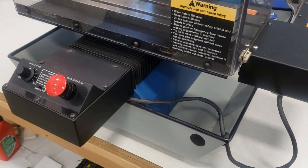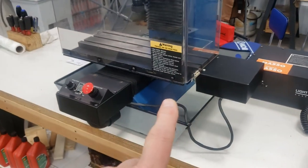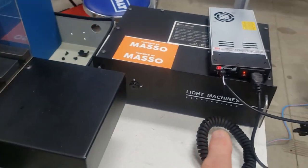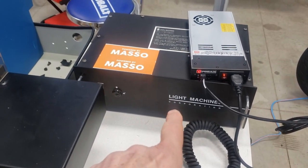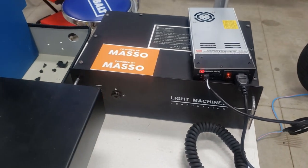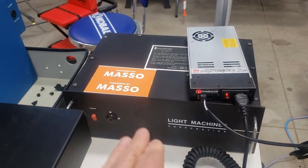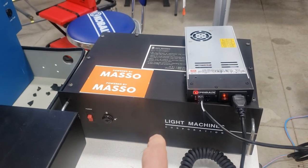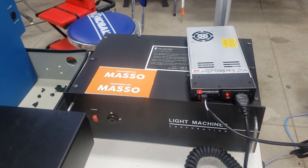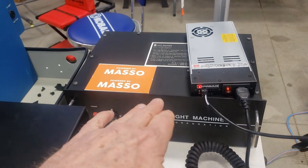I can include some tables on what color the wires are. However, I do have to warn you that with all of these machines the wiring is different — in fact, the control boxes are different. This is your standard control box for light machines. It has some very dated circuit boards in there, and a proprietary card that goes into your computer that operates it on proprietary software. The thing to remember is that these are not the same — one machine will be one way, another will be another way. The interiors of these boxes — I haven't seen two the same. I understand there are probably about four different types available, and we just chucked all that.